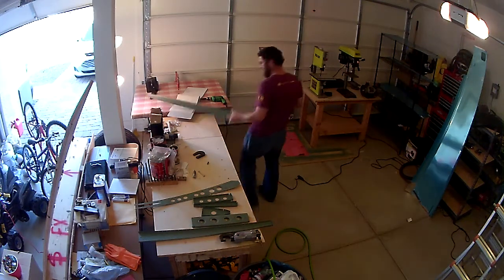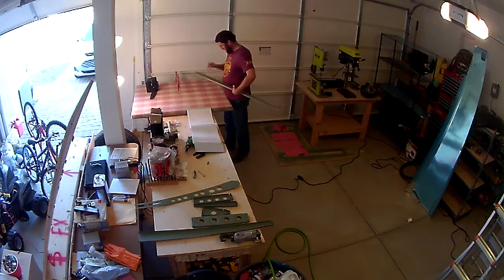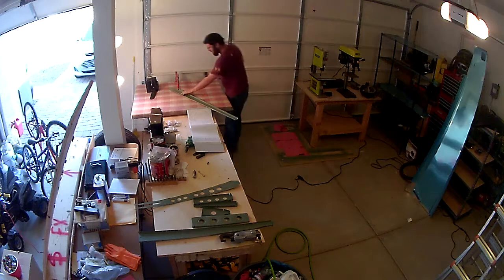So this is, again, the rear spar on the vertical stabilizer, and there are a few holes that you'll dimple. And right there, I'm just verifying to myself which holes need to be dimpled and matching them up, and again using the C-frame here to dimple those.